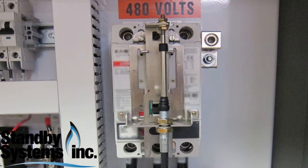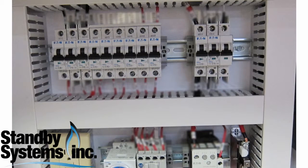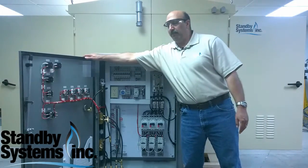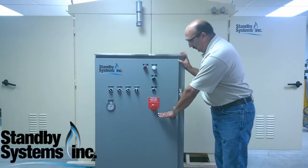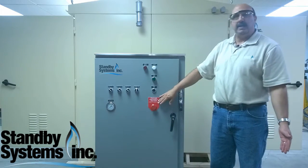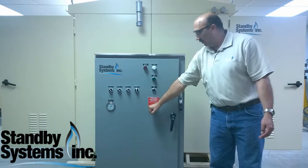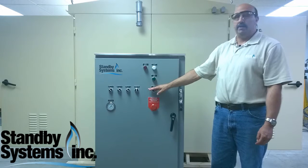The panel features a main disconnect so we can shut all the incoming power off to the panel. The vaporizers each have their own circuit breakers, and we've got miscellaneous relays and circuit breakers for all the other powered equipment in our unit. This panel is a non-rated panel, which means it's for installation in an unclassified area. We can do a Class 1 Div 2 version of this panel. Some of the other features include our main ESD system, which shuts down process valves and equipment at the push of a button — either here on the panel or via remote-mounted buttons located throughout the system.